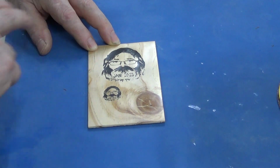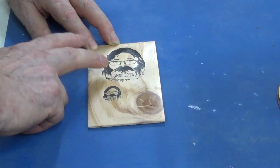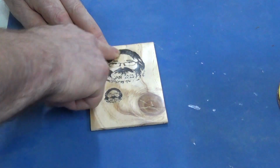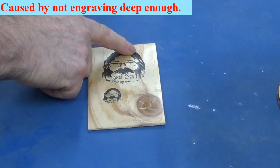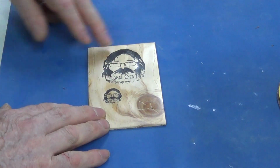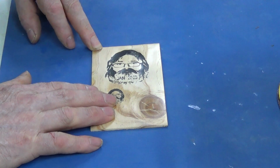And I noticed that a lot of the wood filler was concave, and even to the point where I blew through, I call it blowout, which is basically where you sand through the filler and start hitting the timber underneath the filler. And I just blew out a little bit there. So I thought, damn it, I'll fill it in and sand it back, but it didn't turn up too well. And then on closer look at it, it was pocked. When I say pocked, concave everywhere.